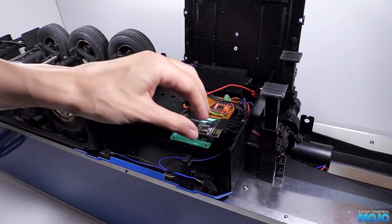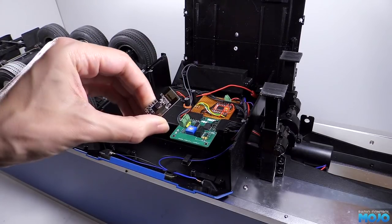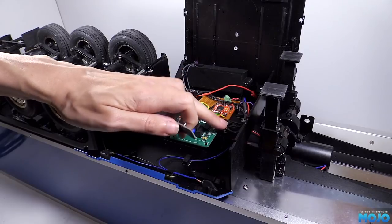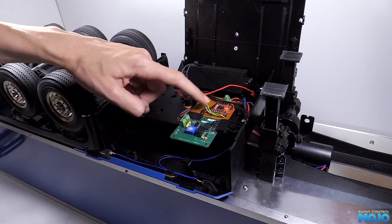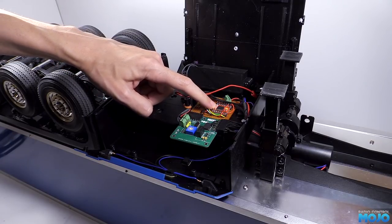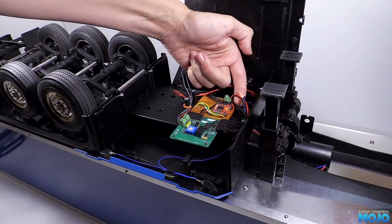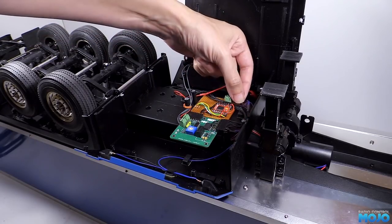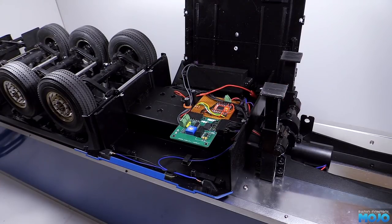We've got the matching radio that lets us talk to the one in the cab, and to the right is the connector that goes off to all the LEDs, mirroring the connector in the cab. The new bit is the rather hurried strip board with a breakout board that has a motor driver sitting on it. It lets the processor on the green board send it a signal to control the motor on the Tamiya legs. The motor wires come straight in and get plugged into a 2-pin screw terminal.